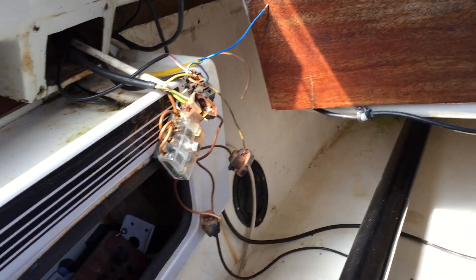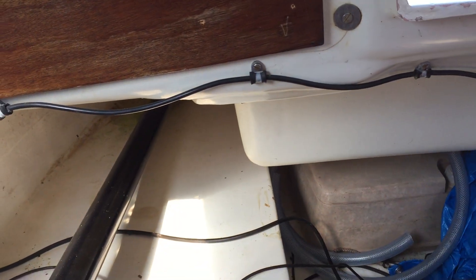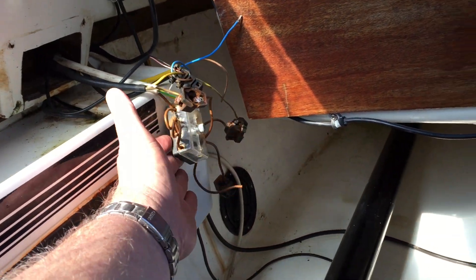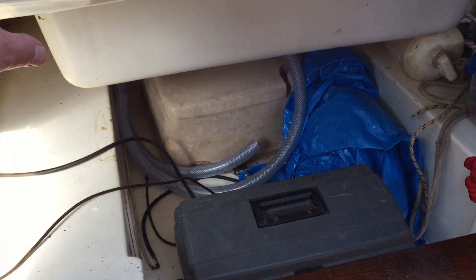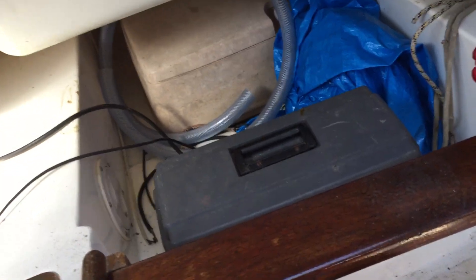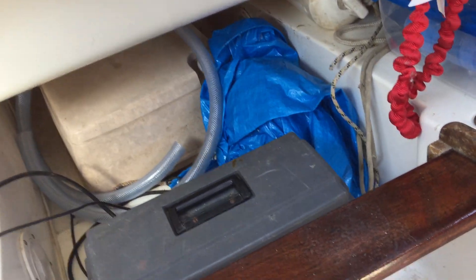The rest of the stuff is still at home so I haven't refitted it yet. I haven't completed the electrical work but I have bought a lot of the necessary equipment - cables, batteries, switches and everything - to replace all of this with new wiring. A battery will go in the stern locker and I have straps for that. I'll make a cabinet to sit here with a switchboard, a fuse board, an off switch and the main fuse. I don't want the battery up here in the cockpit - this area does get wet, especially here in the west of Ireland.